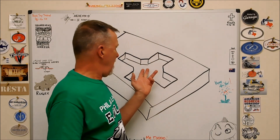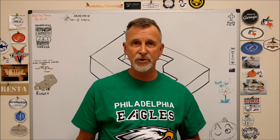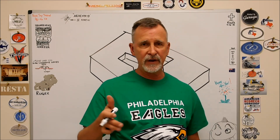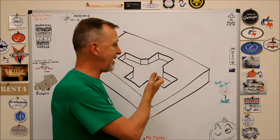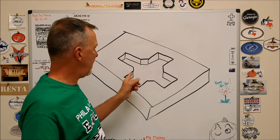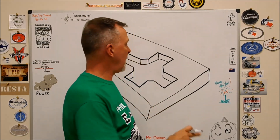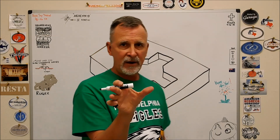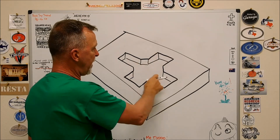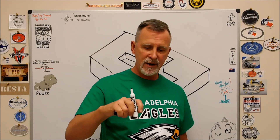The second thought would be wire EDM or broach it out. Broaching on the mill is something that's entirely possible - just line everything up, drop it into a lower gear so nothing shifts around, and have the broach that you need and attack it. We're going to mill out the majority of this part first, then go in with a high speed steel square broach in the mill and shave it off. We'll put break edges on the corners by manually rotating the broach 45 degrees.